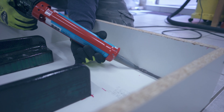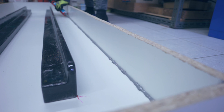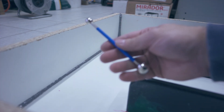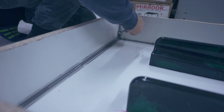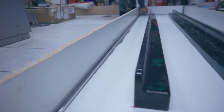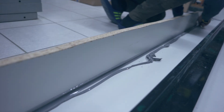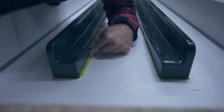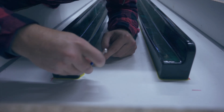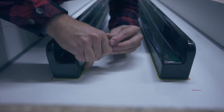To make it waterproof I laid down a bead of regular cheap silicone. I can recommend these sculpting ball tools that help you leave a nice curved bead. If you're not an idiot like me, you can pull off the excess silicone after an hour or two rather than when it's almost completely set. The only thing left was putting on the filleting wax around the extensions so the gel coat wouldn't run under the part and create a mechanical lock. I used the same tool as with the silicone but with a smaller ball to create a much smaller radius curve.